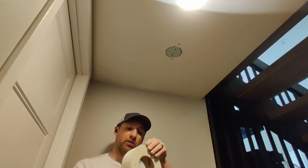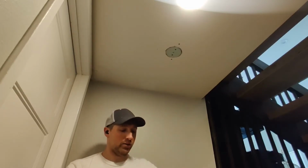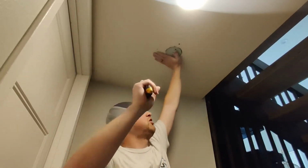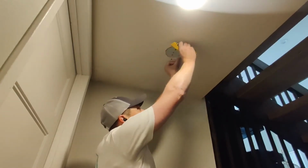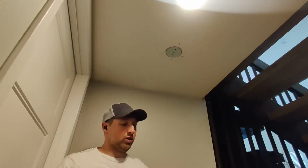Next, you're going to get some fiber tape, I think is what it's called. But it's just in the drywall section at any Lowe's or Home Depot. And it is a mesh tape. I like this better than the paper tape. Especially if you're beginning, I would think this would be far easier. And you're going to want to place this tape on the seams. The tape helps prevent cracking. It gives it a little bit of strength. It also gives the drywall mud a good textured surface to stick to.